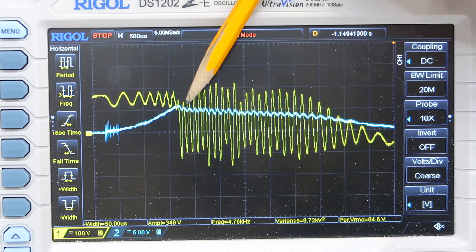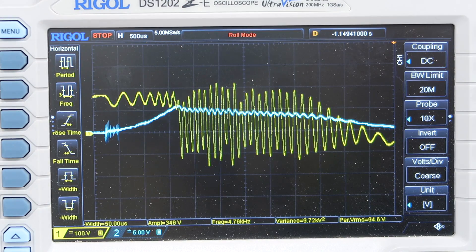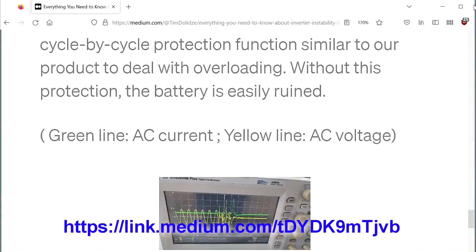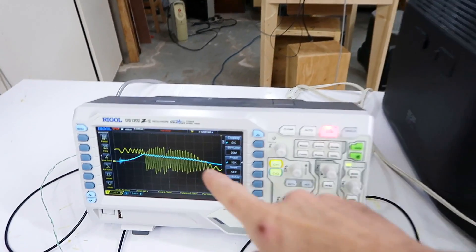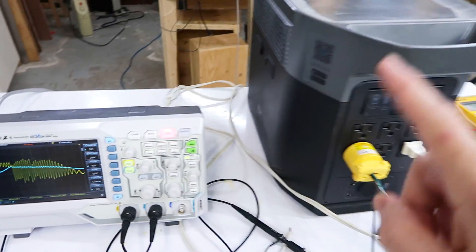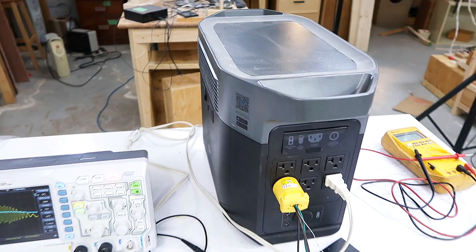This being a hardware protection circuit, it's somewhat less graceful than the control algorithm for the inverter that normally runs things. They also wrote an article that I put on medium.com explaining this whole thing in more detail. It's amazing that this thing is able to put out that much current at all. And if it weren't for the risk of blowing a transistor, there's also a 100 amp fuse on the 54 volt battery pack — so if they kept going at that, even if the transistors didn't blow, possibly the fuse to the battery pack would blow, because it's so overloading everything. While these high frequency oscillations can cause damage to things like a kilowatt meter, it's nice that it at least protects itself, because blowing the EcoFlow would be a heck of a lot more expensive.